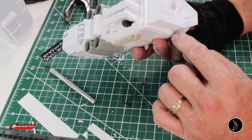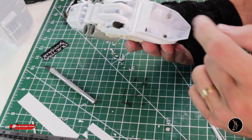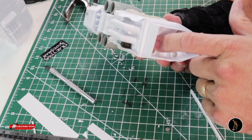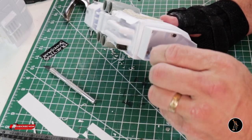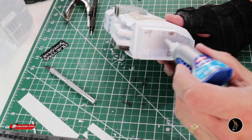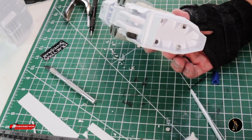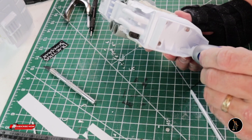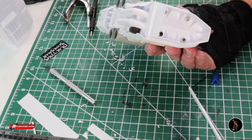I already have the riser built. It's kind of mapped on here where I want it to be. I have the magnets in there — they're not glued yet and I circled where I want them. Now I'm going to glue these in. They're pretty sturdy even with the plastic in between them. I'm going to use some magnets I already have, get the right polarization, and put a dab of glue there. Get a magnet, let it drop in. Get the other one, put a dab of glue, get another magnet — pretty easy.